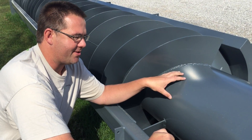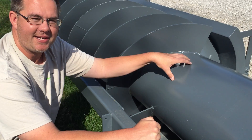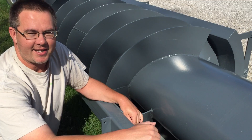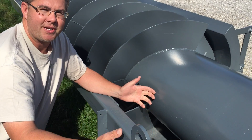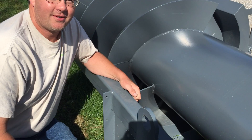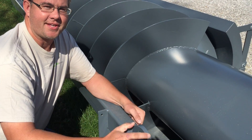In this case we had to build a screw for three meters of head, so we were fixed with an 18-inch inside pipe. We need a certain ID-to-OD ratio to maintain efficiency, so the parameters of this screw are built for its installation. In some cases it would make sense to put a trough extension on to fill it up another 30 percent to make more power, but extra water put to it is not used as efficiently as just filling the screw up to 100 percent.